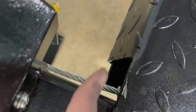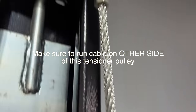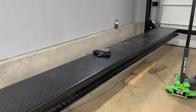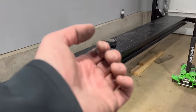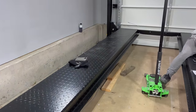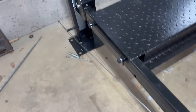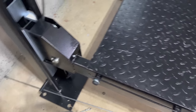We ran the cables. The way they come, the cables are tucked back going that direction — you need to pull them around the pulley so the end can come out. It's going to do a 90, come up through two pulleys all the way up, and then connect there. That wasn't too bad, but it was kind of hard to get them back around the pulley inside. Pro tip: there is a hydraulic cylinder underneath — you want it all the way out so you have enough slack to run cables. Now that everything's finger-tight, we're tightening all the cap heads and everything down. Then we'll put the control system on — we should have done it earlier, but it's probably a lot easier now that this thing is off the ground.